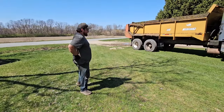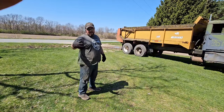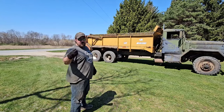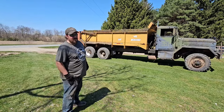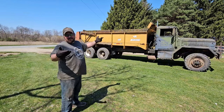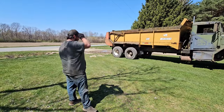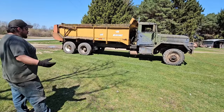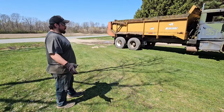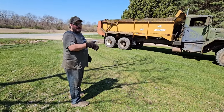Yep. And I was watching the fuel, I've got a clear fuel filter on the boat tank. Originally, it was half full, flowing good, and when it started dying, it was barely pulling any fuel through it, and it was dry. So either it wasn't pulling, or maybe the pickup in the boat tank is leaking, and so it was sucking a bunch of air. That's another thing to check, maybe you've got a crack at a certain point. That's possible. It was just a boat tank to get it out of its hole and get it home. It runs. We didn't blow it up. Right up until it ran out of fuel, it was running better and better.